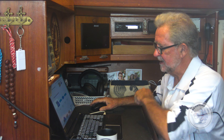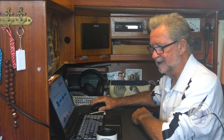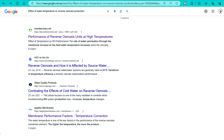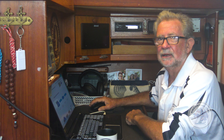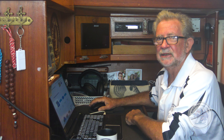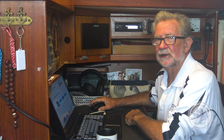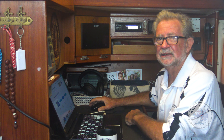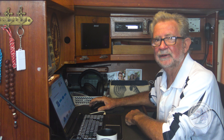That figure shocked me, so I went straight to Google and checked the Rain Man site — they claim 120 to 140 litres per hour. But then I looked at the effect of water temperature: for every degree warmer, you get an extra three percent output. We're in Indonesia near the equator at 30°C water temperature, versus Australian summer water temperature of around 24–25°C — so we're five to six degrees higher, meaning about 15% more production output. Hence the 170 litres per hour up here.